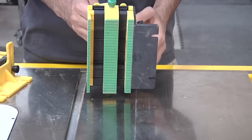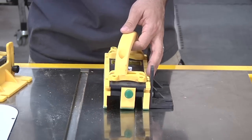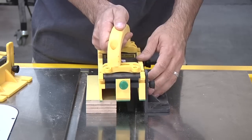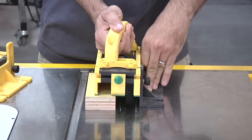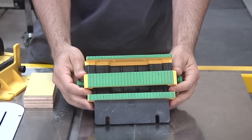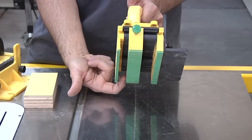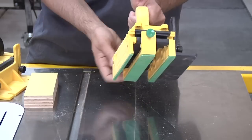Let's take a closer look at the underside so you can see what's really going on. First, there's a plate on the outside that helps to balance the Gripper as you're running it over the saw. If you're just getting the end of the Gripper on the work piece, that wouldn't be very stable without some support on the outside — that's what this plate is for. You put the Gripper right on top of the work piece, push it down, press down on this little shoe or foot, and tighten it in place — now you're completely stabilized as you push it across the tool. There's also a movable foot on the underside; you can position it depending on where you'll be placing the Gripper in relation to the blade. It also allows the blade to pass through a channel safely without contacting the Gripper itself.